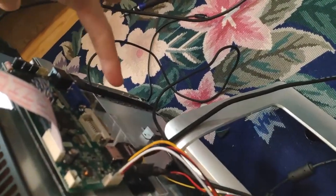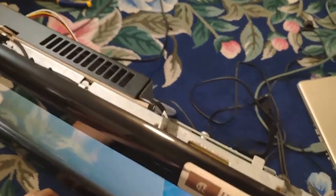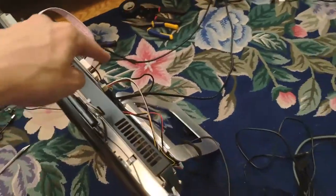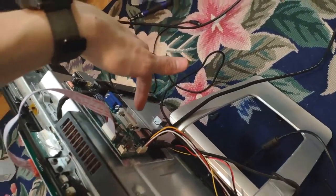This will eventually use the DVI end, because this is a DVI output. I don't have a spare straight DVI-to-DVI cable right now. DVI is just worse HDMI, and most DVI era components also have VGA — and I have a ton of VGA cables — but this only has DVI. So I need a DVI-to-DVI cable, and I ordered one at the same time I ordered this LVDS driver, but the driver came first. So we'll put a straight-through DVI cable there, which leaves the HDMI and VGA ports free — the two connectors I use most often anyway.